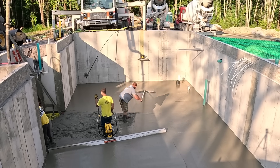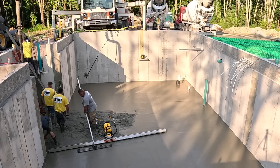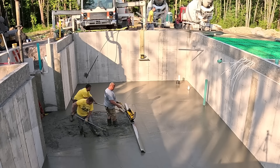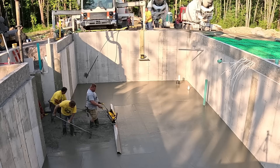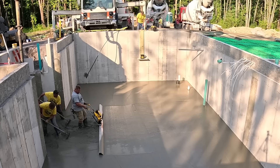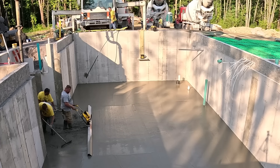Probably the hardest part is just getting it back out of the foundation. Once we get the house done, you can see the other two trucks are sitting up there waiting. Those two trucks will do the garage and that back patio. We're going to hustle to get them down before that concrete gets too hot. We try to order concrete for as early as possible. Today the earliest we could get it was 7 a.m., partly because we're working in a city with laws that say you can't start any job before 7 a.m. because of sound — they don't want us waking everybody up.